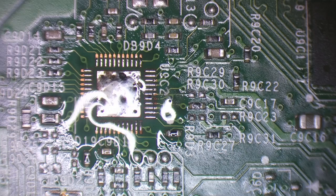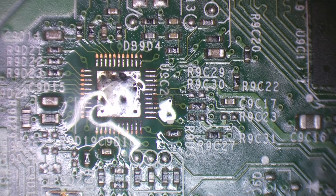So, like I said, this is the NCP4205 and it is a power management IC by On Semiconductor. You can get it from AliExpress. I'm going to take mine from a donor board though. And actually, not yet, because as I've just turned my hot air on, I've realised that we might have some damaged traces around that PMIC.